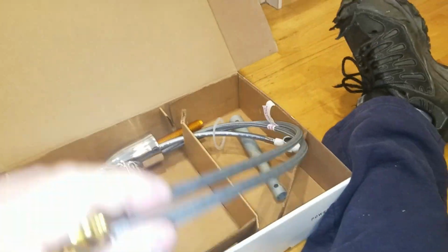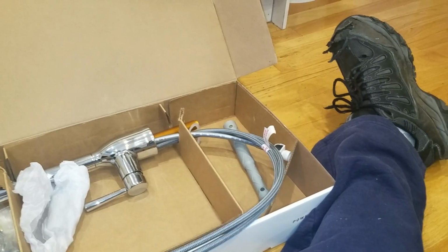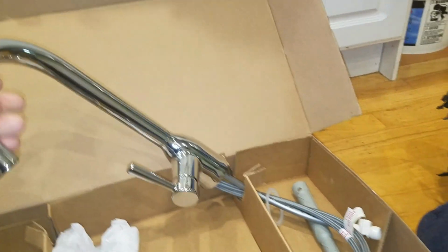We're going to yank out this here faucet. Also, we're going to have new long hoses on the new faucet. So we have the copper extensions, hose connections that come down from the valve above, and then you put your flexible risers onto that, which go into the valve. And the new valve has these nice long, close to 30-inch long flex risers on them, so hopefully that will work out nicely. And it is a chrome valve, which will go that way.